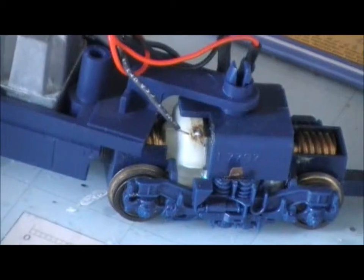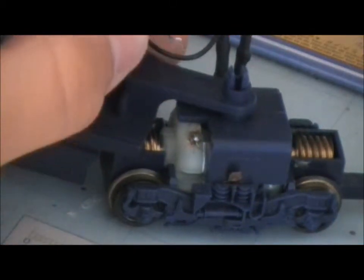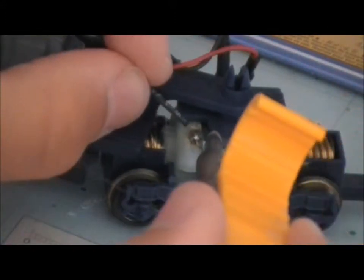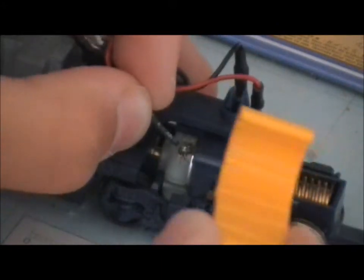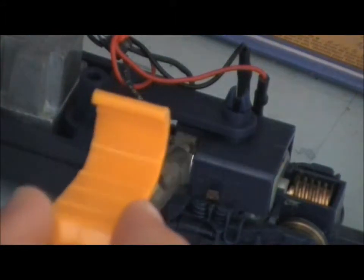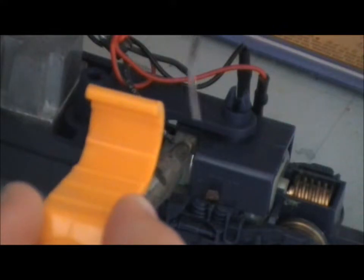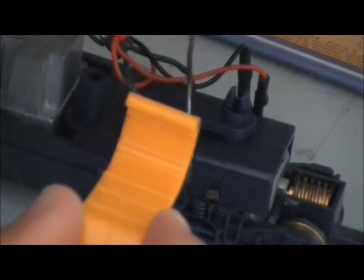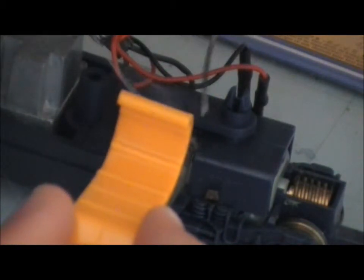So you want to take the wire that you're going to be soldering to the motor, then heat up both surfaces — making sure not to melt any of the plastic — then get your solder and just dab it onto the joint. There's a nice join there.